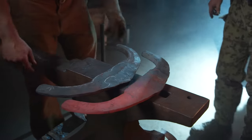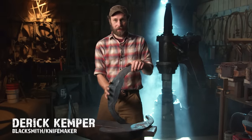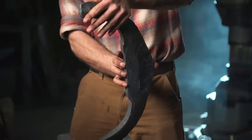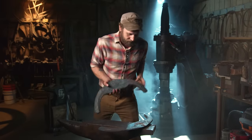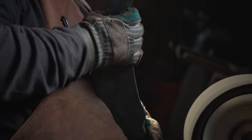Kevin and Cary got the edge forgings rocked out — forgings are all done. These were a fun forging to do, getting the right width and curvature. Getting the right width and pushing in the shoulders was a little challenging but kind of fun. They've got two that match, and this will now go to Bill for grinding.